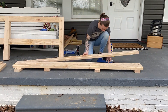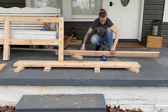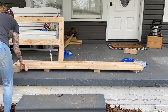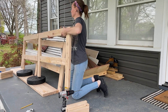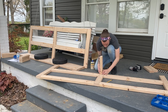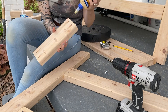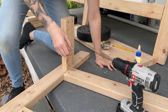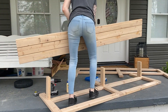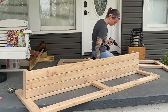Now I'm going to be assembling the shelf that is going to go on this project. I made the shelf out of two by fours, but the top of it will be out of two by sixes, which you will see here in a little bit. This is a more practical and realistic view for you guys on why it is so important to pre-drill your screw holes, because you would never be able to screw those together without it looking nice and clean without seeing all the screws.